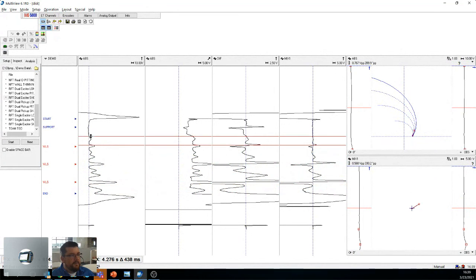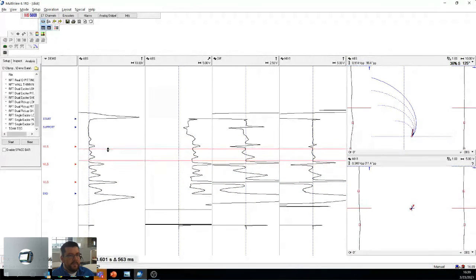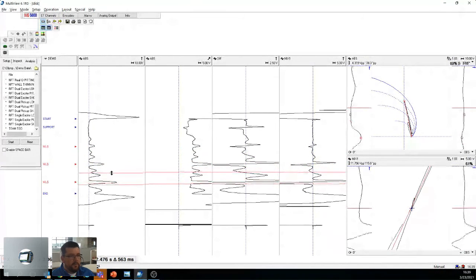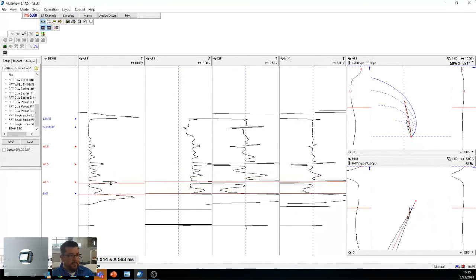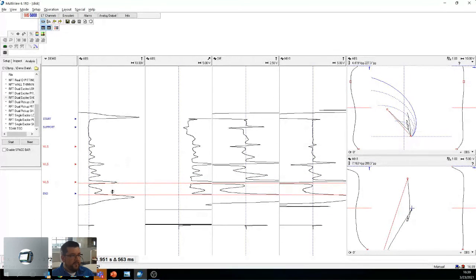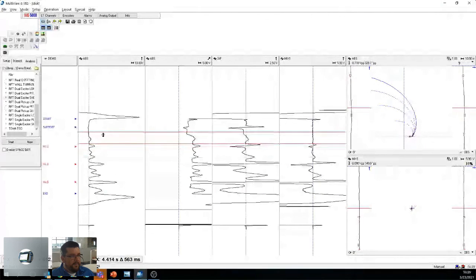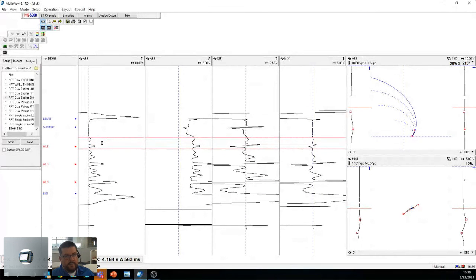So this is where it gets a bit more complicated for the analysis aspect of using a dual exciter probe. The signal's clear, everything's fine. If you're going around a support, you'll get both sides of the support. But if all you're looking at are short defects and there's nothing around the support, and this is because as an inspector, you know what you're looking for, this might not be the best probe, because then it makes your analysis harder.